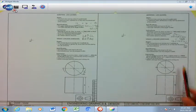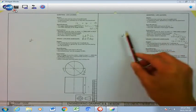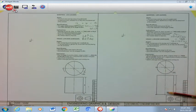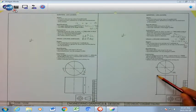So to start off, we're going to use step 1 by redrawing the given information, dividing that circle into 12 spacings. Divide this into 30 spacings of 4 millimeters each, and plot my point as it makes its way around for 2.5 turns to reach that point over there, which is opposite to the starting point at the bottom. Please complete this drawing by following the steps very carefully.